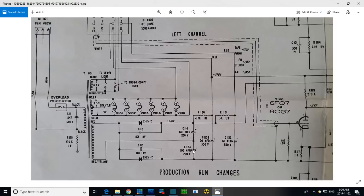So getting back to this, if the hum is coming from here, I've got to try to stick an additional 100. If I just parallel one of these, is that going to be enough to make a difference? I've got to parallel them both. 100. Strikes me, just thinking about it, that if these are weak now and hummy, I'd have to remove these and replace them. 100 microfarads, 200 volts. Well, I think I can do it.